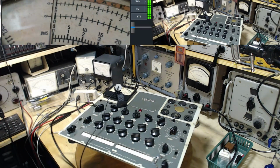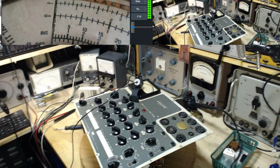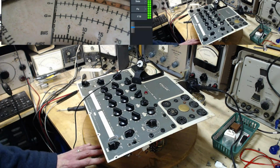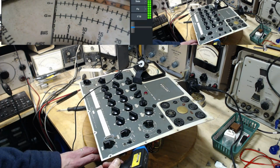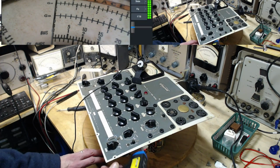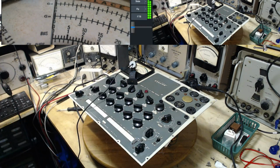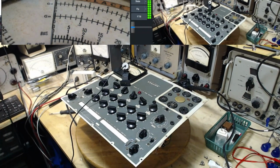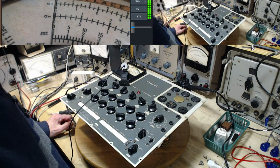Are these resistors getting warm again? Oh yeah. Let's just stick your finger on there, Jim, and find out. How about we do it a little bit on the smarter side? Maybe these aren't running this time. 140°C. Yeah, no, 155. No wonder they're calling for 10 watts. Good thing I put 2.5s there. Wow, that's really hot. No wonder I came as close to burning my finger for real as I want to.